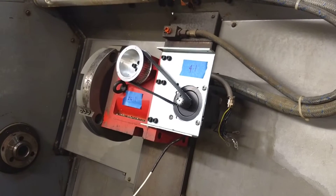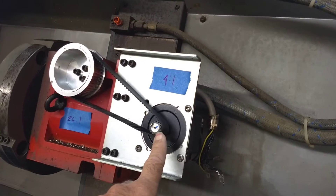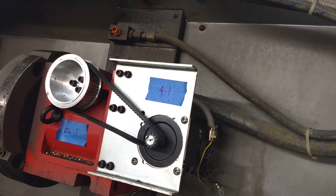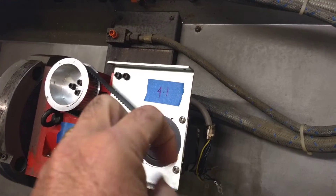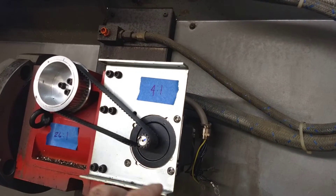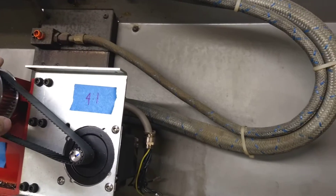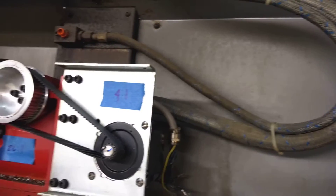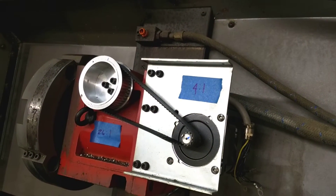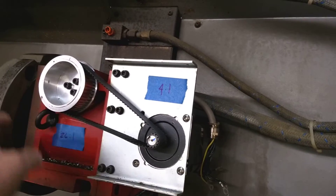I've got a little challenge. Something I want to try is I'm going to use a larger drive pulley here with a bushing that locks the pulley to the shaft so I can time it. The idea is to use the DMM index pulse to time it to tool one in the turret, so that when the index pulse comes around and I home the machine, it will set the turret to tool one.